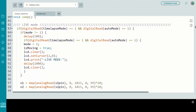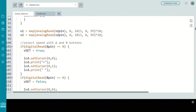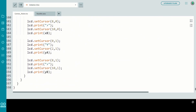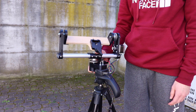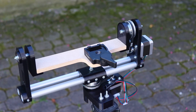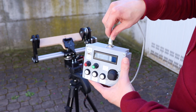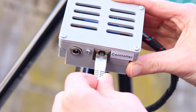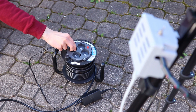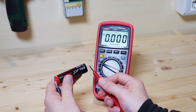At this point I wrote the code for the Arduino. And after writing 500 lines of code and solving about a million problems it all seems to work. I mounted the robot on the tripod that I normally use for the camera, and on top of the robot I put a quick release plate to mount the camera. I connected the remote control to the robot with an Ethernet cable. To power the robot I used a 12V power supply, but maybe in the future I will add the option to power it with batteries.